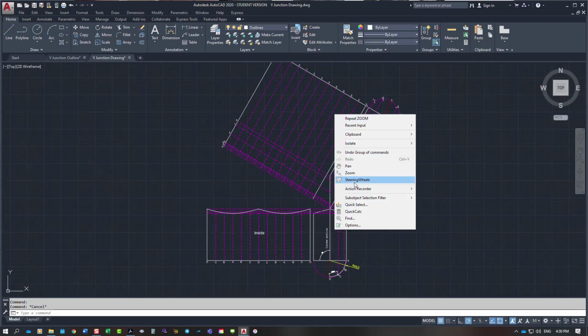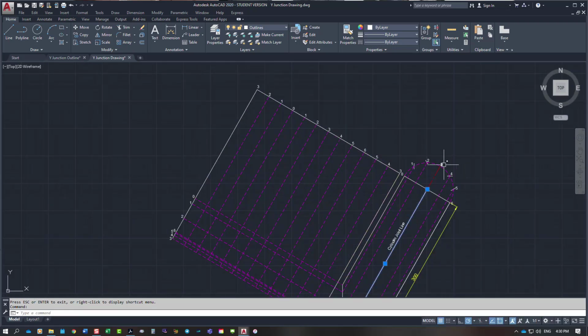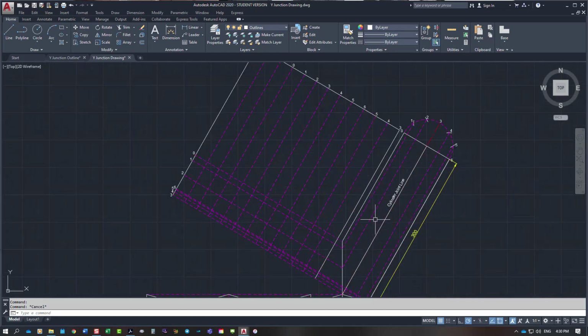So in order for the cylinder to roll out correctly, the joint line is on number 3, so we have 3 at the start, we have 3 in the middle, and we have 3 at the end. This line here will roll across from 3 towards the other 3. So on this end we have 3, 2, 1, 0, 1, 2, 3. This line is heading in the opposite direction. It's heading out this way. It's rolling back across. So on this side we have 3, 4, 5, 6, 5, 4, 3. So that's how we have those lines going across there in different ways.